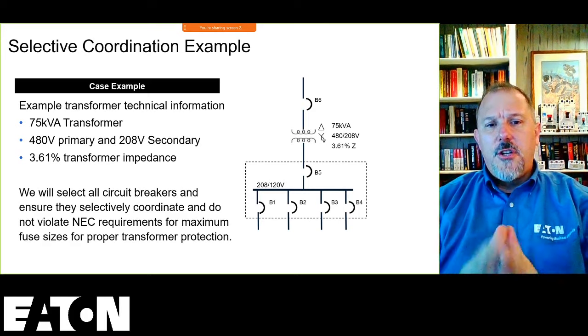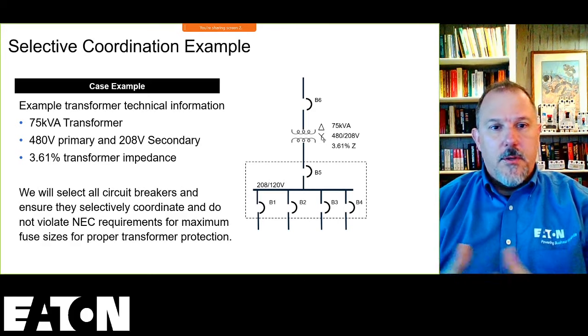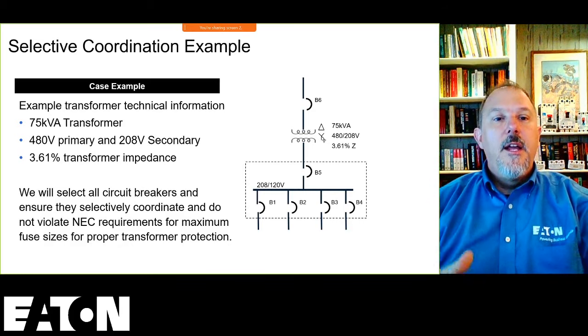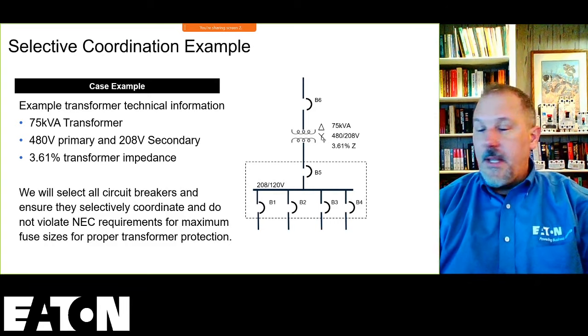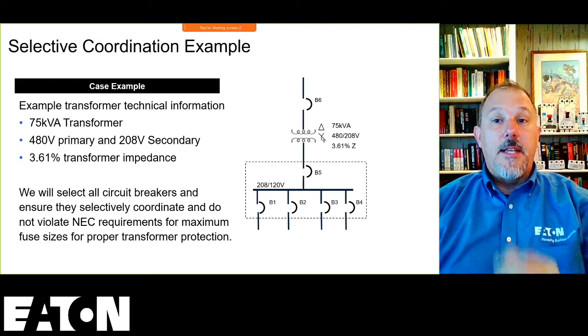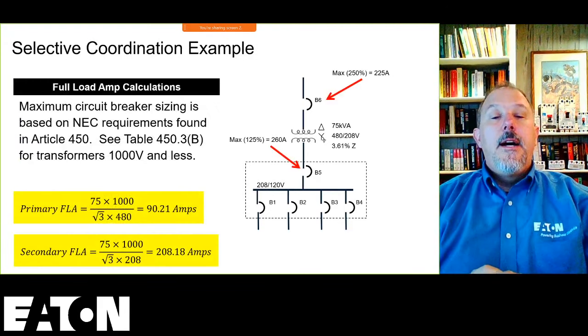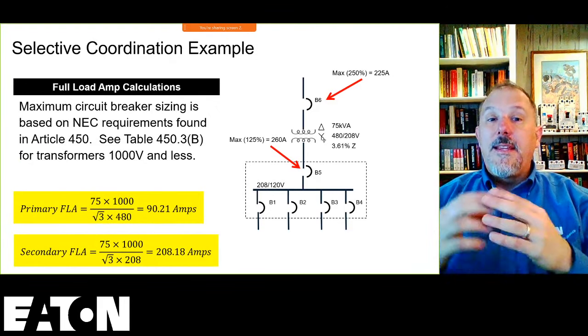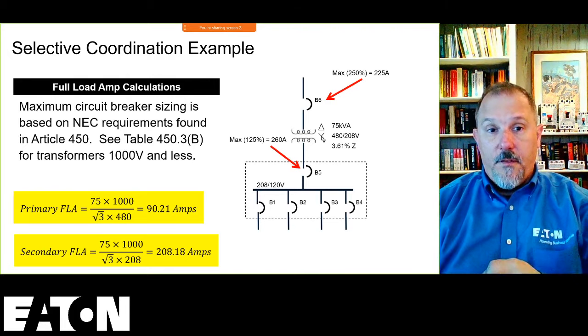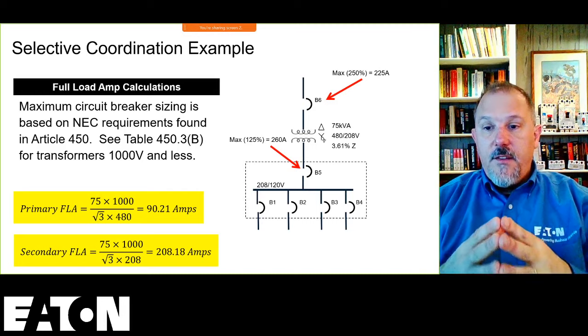So I'm going to show you around a transformer because a lot of people don't understand this. I have an example: a 75 kVA transformer, 480 volt primary, a 208 volt secondary, 3.61% transformer impedance. We're going to select all of the circuit breakers in this application, primary and secondary, and those branch breakers so that they selectively coordinate and meet the code requirements in Article 450. Now, if you look in 450,